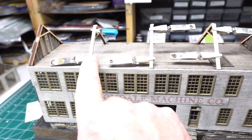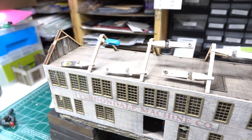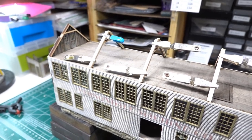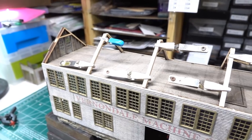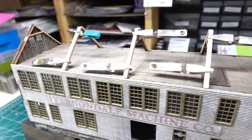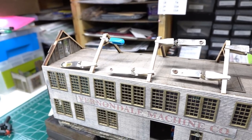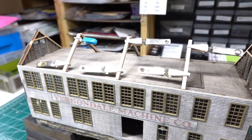So even if I left them in, if I hadn't done something, which you can see what I did, I just scabbed on a piece of 2x12 and 3x12 glued together and then glued to the roof truss. Because what that does is it then makes it flush across the roof. And the way I determined that was a little science experiment.